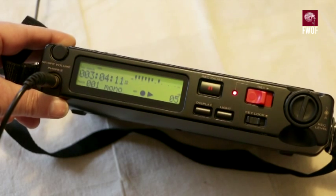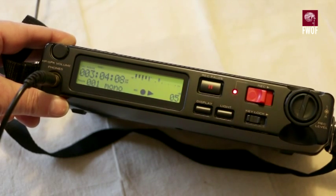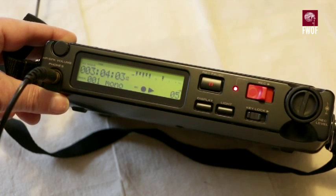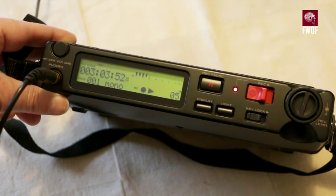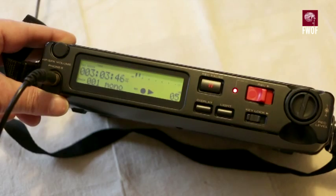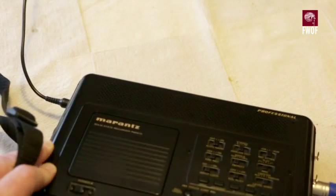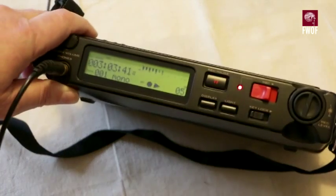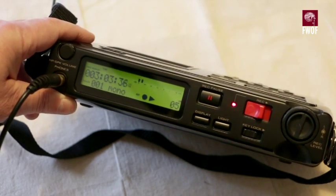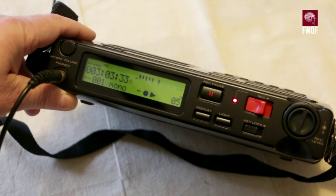This thing has a variety of recording modes, both in terms of sources and formats. The sources are XLR microphone inputs on the side with phantom power globally switched for the two microphones. You can record just one as mono or both as stereo. There are also built-in microphones — rather crude built-in microphones on this thing. You can also record from the line in, and record digitally in — there's SPDIF in and out, which I've never had to use.